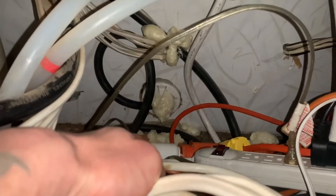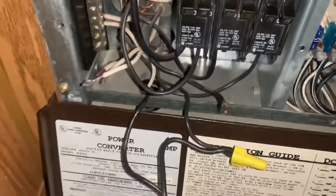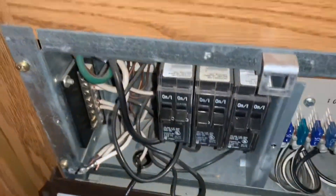We'll hook onto the negative and get the positive over here so we can have it fused. Back here is where it'll sit with all the timers and the other inverter. That plug leads to the socket up here, and we've got another light down there for if we need to work directly off the battery while the load is turned off on the charge controller — since the load switch shuts down all the DC in the whole trailer. We can shut down all AC and DC and still have that direct battery connection to run tools and have light.